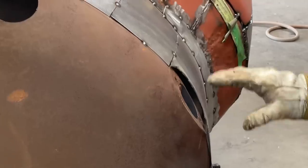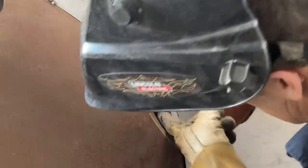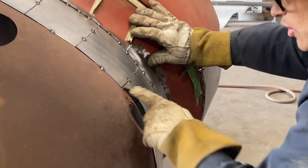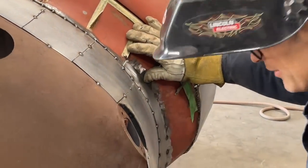I like how this is shaped right here. So what's going to happen is, when I cut this all off in here and start butt welding this together, I'm going to go inside and cut around that taillight piece, take the structure away from that little piece, and then pull this out to match that. Basically, I think that's what I'm going to do.